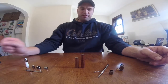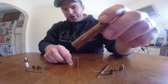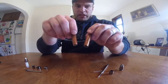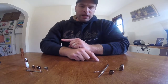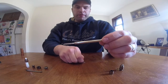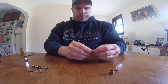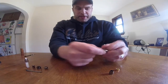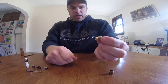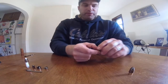I'm going to show you what this kit consists of. There are two tubes, and I actually already have these turned and ready to assemble. There's a much longer lower tube and a much shorter upper tube for this two-tube click pen. It calls for a 10mm drill bit, and I found that worked well. We have a Parker style ballpoint refill and a basic ballpoint spring. There's a nib piece and a little brass piece that screws onto it — that brass piece goes inside the bottom of the long tube. And there's a connector piece that connects the two tubes together.